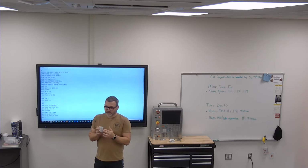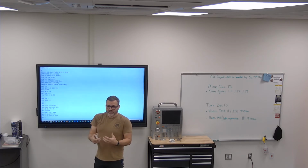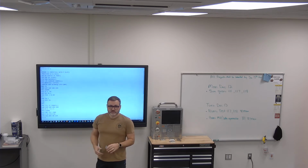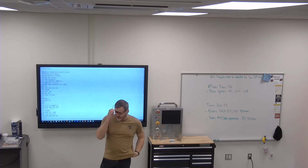It really needs to be, this is about 1/8 of an inch. Really 124 is perfect because it'll draw this down onto it. So it'll pull it down into it. The more it pulls it down, the tighter it gets, the better the grip. You said 124, what do you mean? 124 thousandths. That's 0.124, so it's just a thou short of 1/8 of an inch.